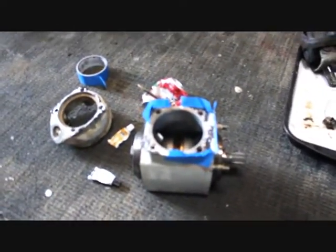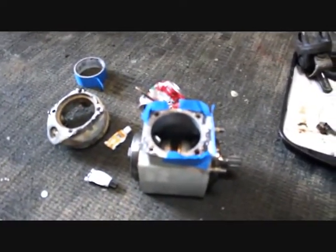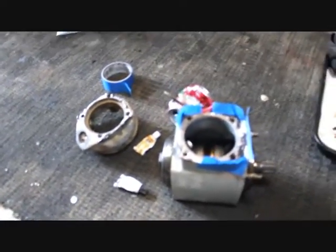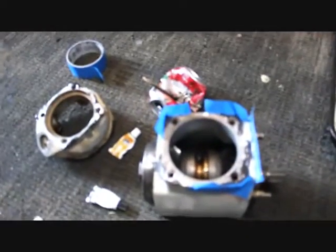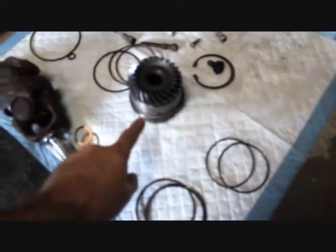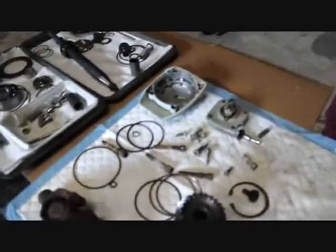The problem is the pieces inside different ones have different gears, different yokes, different bearing cases — it's everything. We found that some of them have splines on their drive shafts, other ones are flat. This whole bearing case is a totally different design from drive to drive.